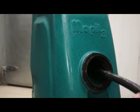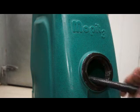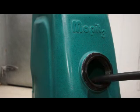The Moppet dirty water tank will need to be cleaned regularly. When the tank gets dirty, the machine will start to smell bad when you turn on the vacuum. To prevent this smell, always drain the dirty water tank after use and clean out the dirty water tank often. After cleaning, you may also spray some bleach in the tank to get rid of foul odors.